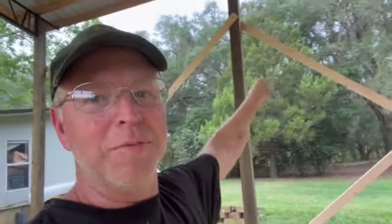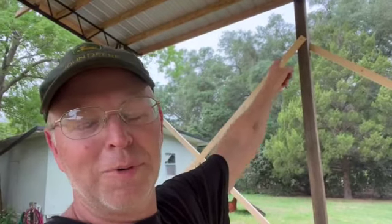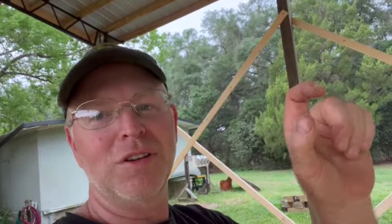On the next board that comes out of it, like that, I just found the relative centerpiece. So I basically just measured off a generic middle from one of the previous ones. So 2 3/8 inch down the board and 1 3/4 inch. So halfway across, 1 3/4 inch. Just drill a hole, slap it on, slam it to the next one, and just kind of lather, rinse, repeat. So yeah, once I got into a rhythm there, it went pretty quick.